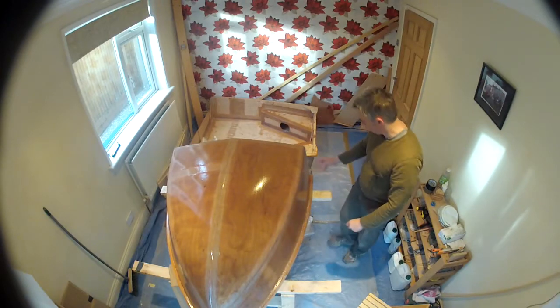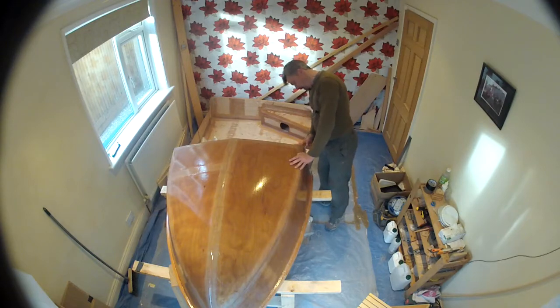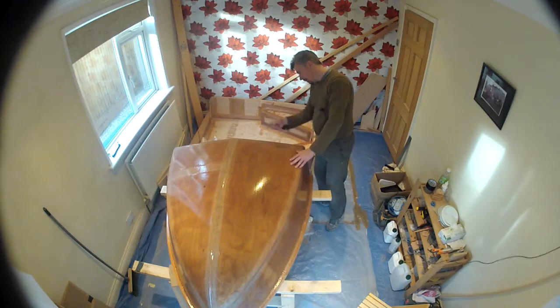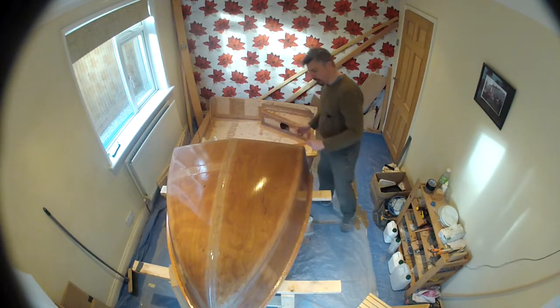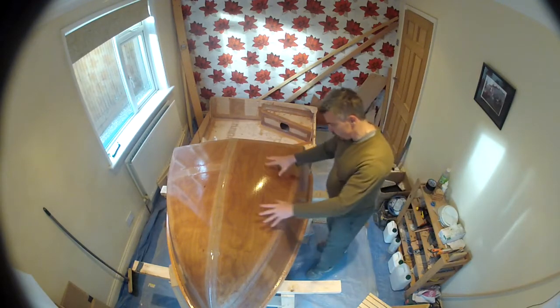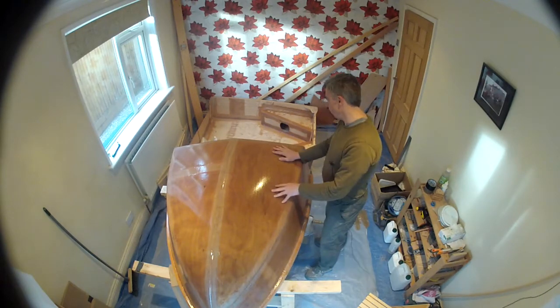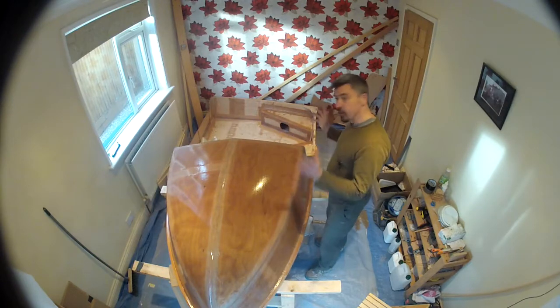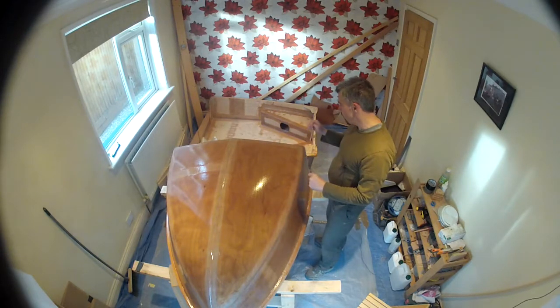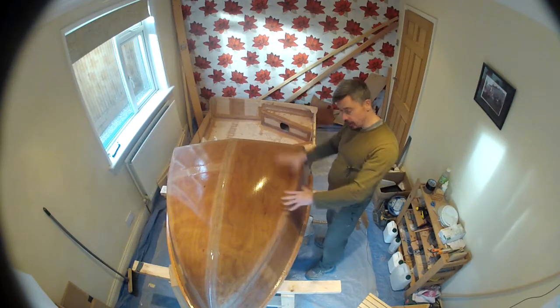I've also got these edges to deal with all around here, and then I'm going to need to re-drill the holes for the nesting bulkhead so they can join together. So the first job today is to get this trimmed down, re-drill those holes, then try to join the two halves together and see if there's any more sanding needed on the aft section before that one gets glassed over.